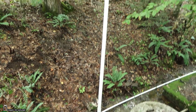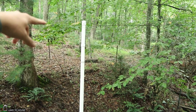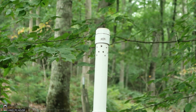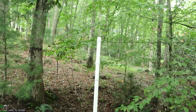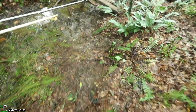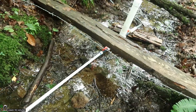To fix this problem, one thing we're going to do is take the stand pipe out from its current location and place it right down here into this little hole. We're already going to have plenty of pressure right in here. The drive pipe will then go from this point over to the pump, which we may extend out a little further to get a longer drive pipe. That should allow us to have enough pressure feeding the new stand pipe location.